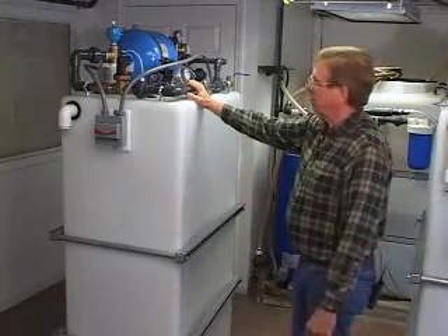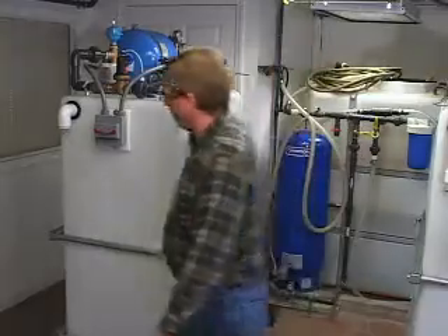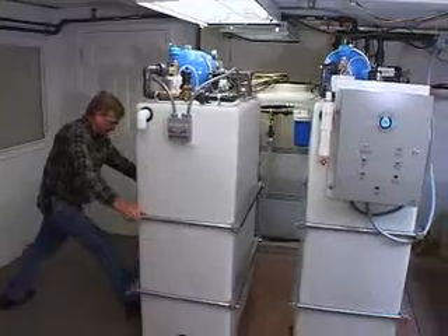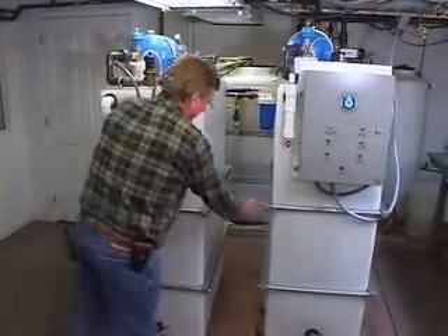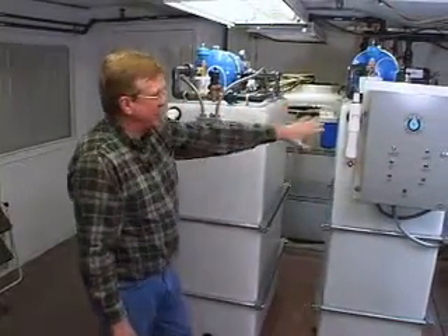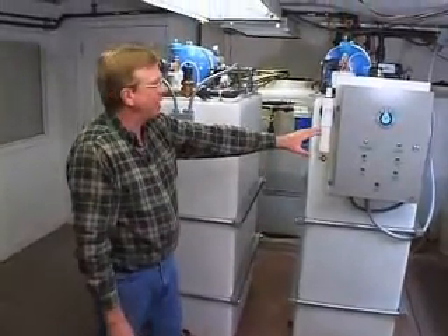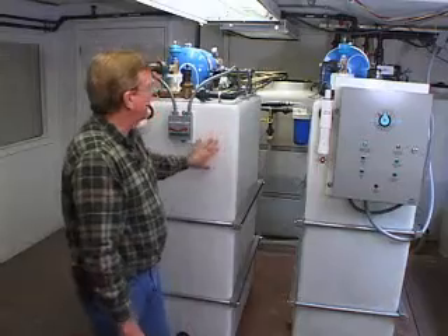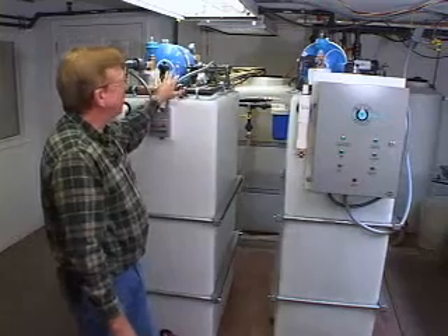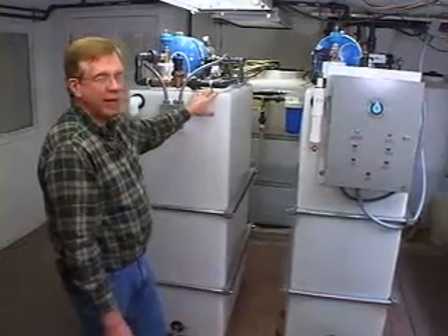There are a lot of things you can do with these. You can also use them with a well manager — put them together and push them together; they bolt together in the center as a single system. I don't need a fill line because the well manager is doing the filling, and I connect the two together at the bottom. The well manager manages the well. I now have 400 gallons of storage and two times the pump output. So if these are 20-gallon-a-minute pumps, I'm now pumping 40 gallons a minute into a very large house — and doing all of this maybe on a one-gallon-a-minute well.